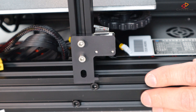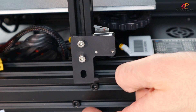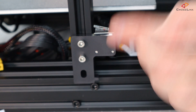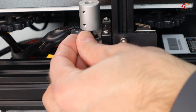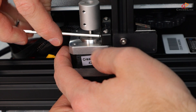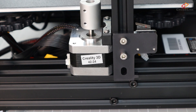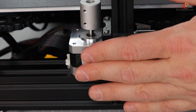The manual says 32 millimeters of distance should be set for this part to the lower end of the frame, but it's actually 35. These two screws go to the front of this motor and seem to go directly into the frame. That was step number four — we have mounted the motor here on the left side of the printer.